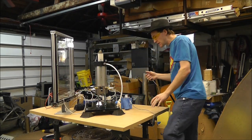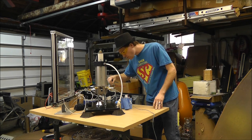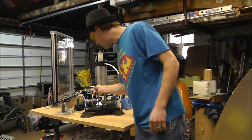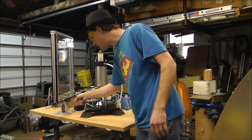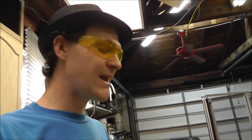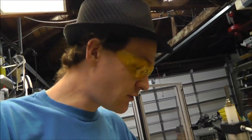Quickly, while I'm taking this apart, I did want to mention something. I really think a lot of the heat that is coming from somewhere actually has to do with the electrical process. The fact that I'm dumping a bunch of energy through a thin piece of metal, a quarter inch tungsten rod, and probably a number 8 wire, that alone to me is creating a lot of the heat, because these rods themselves are pretty hot, but the rest of the unit actually isn't.